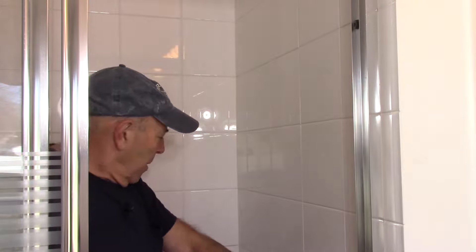The reason we're going to be changing it is I'll bring you in and show you why we need to change the grout versus just sealing it. From about waist height up it's in perfect condition, but from waist height down it's in really poor condition — some of the grout is coming out and it needs to be replaced.